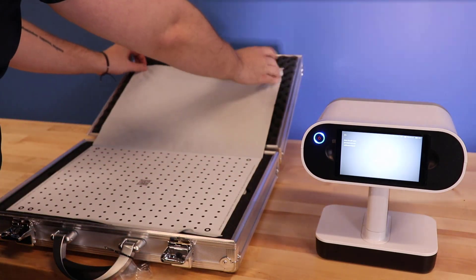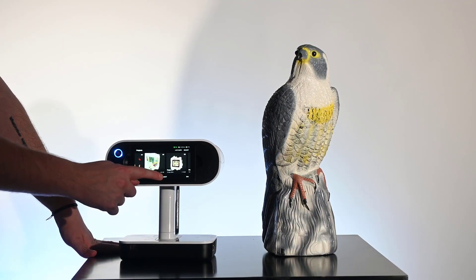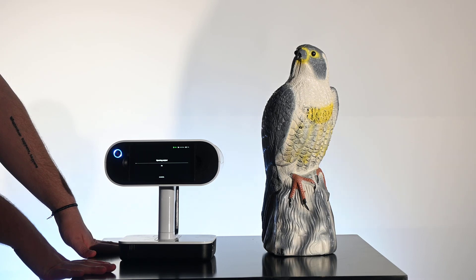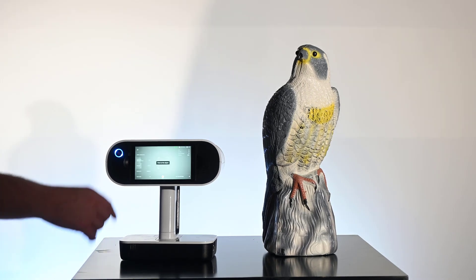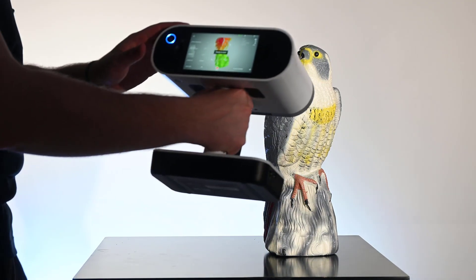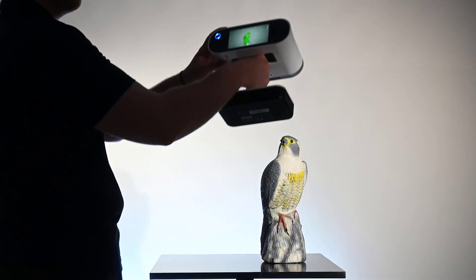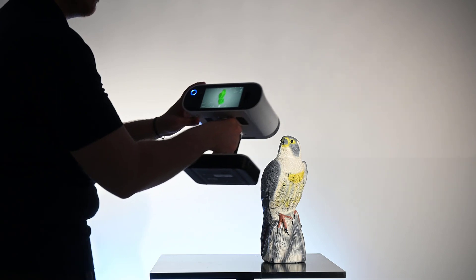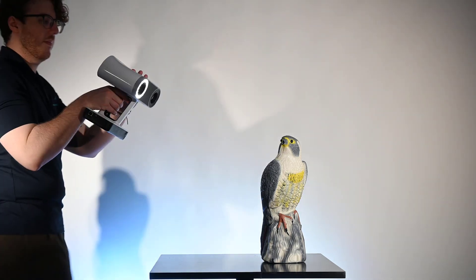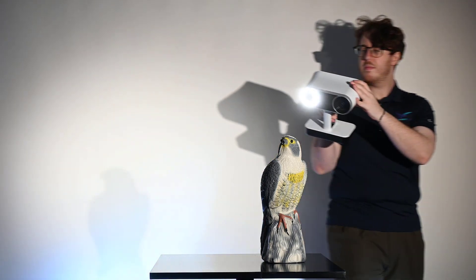Once our settings are adjusted and calibration is finished, we can exit the menu to save all the settings and begin scanning. To start a new project, click on the new project button from the main menu or click on the red scanning trigger when no project is open. Once the object is visible within the scanning window and our distance histogram has the object colored green, we can click the scan button to begin capturing data. We'll have the scanner's temperature and total frames captured indicated at the top right, and we know data is being captured when areas we pass through remain on the screen and our frame count goes up.